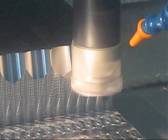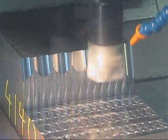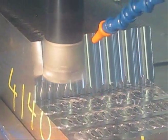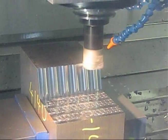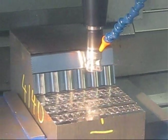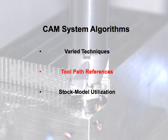A few seconds ago I said that we don't go off at an angle — generally you don't want to do that. There are times when you can, but it's going to have an impact on your tool life because you've started to load on that tool. As an insert becomes engaged in material, it rotates around the tool axis, hits the material, and stops dead in its tracks for just a microsecond — then you've got the spindle continuing to turn. It's similar to bending your fingers backwards. As you gradually lessen the engagement by tapering off to the side, that causes an uneven load and results in poorer tool life. It can be done if you have the right software.